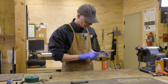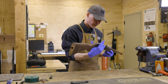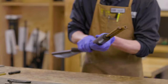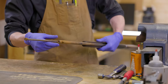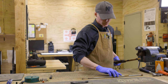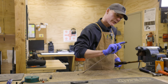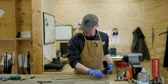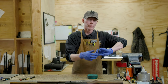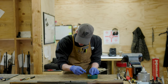This is probably aluminum, looking at it, so there's not going to be any rust on that - it probably is on the inside, but we'll deal with that later. I'll pull the inner magazine tube out, which actually comes out nice and freely. It's fairly rust free except for the exposed parts there - just a little surface rust and a little bit of rust on the knurled knob there. Since I've got that out, we can punch out the retaining pin and get the spring out and get the guts out of this one.